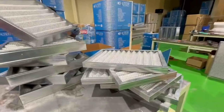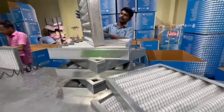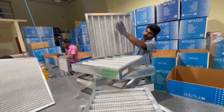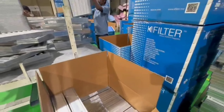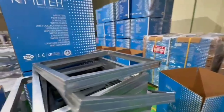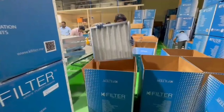Maximum temperature is 70 degrees Celsius. Various frame sizes are available. Benefits include long maintenance intervals, easy installation, and lightweight design. The filter can be installed both horizontally and vertically. Filter media is pleated with mesh support, resistant to microorganisms, and non-toxic.